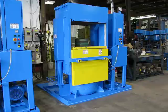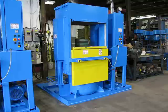Both of these presses are hard guarded in the rear with bolted-on metal guarding. The fronts both have skirting on the front, and the side cylinders have hard guarding over those. The presses each have removable palm buttons on the front for access for installing tooling. The palm buttons are anti-repeat, anti-tiedown, and there's an emergency stop on each panel at the front.